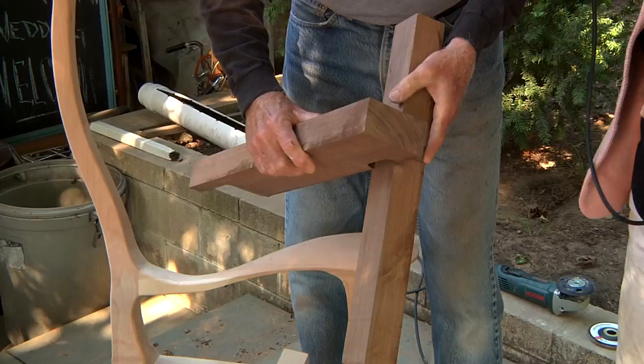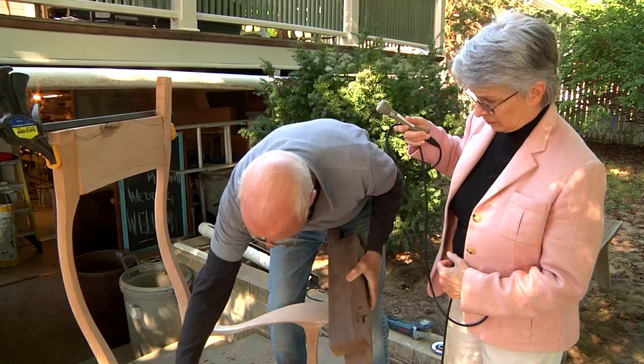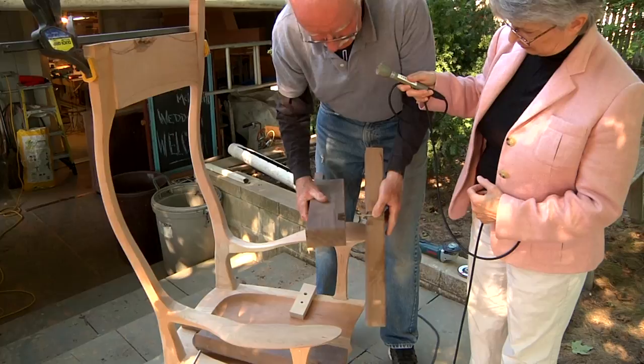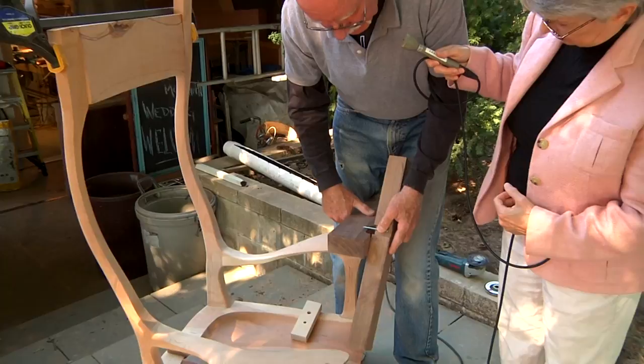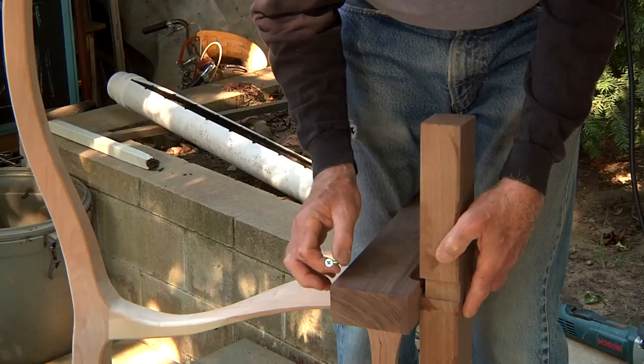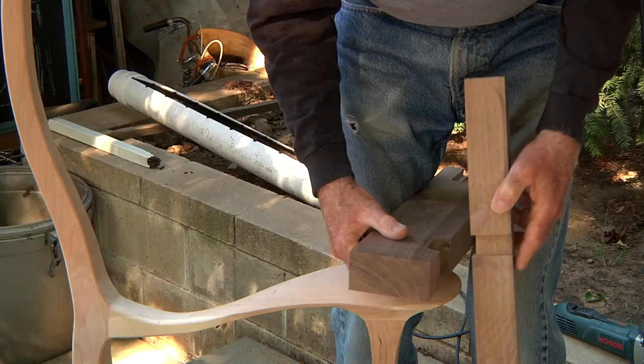After these are put together, glued, and put together to finish — after the glue dries, there's a screw, two screws, that get driven through the seat like this. This screw thread-locks the joint, and these are at a slight angle. When you get done, there's basically a threaded steel dowel that goes from the leg into the seat for the strength of the joint. That, plus the fact that this is a double-shouldered joint, means the joint will never come apart.